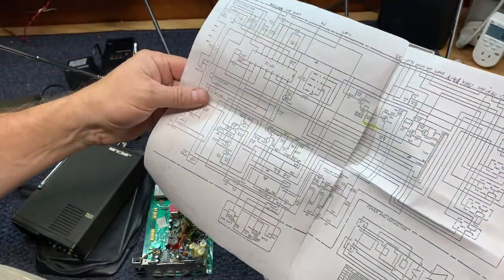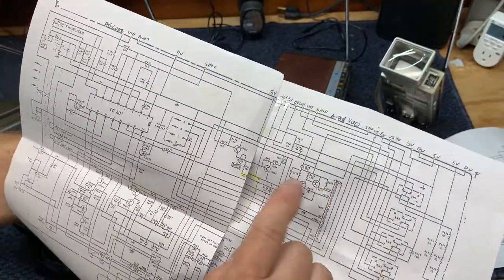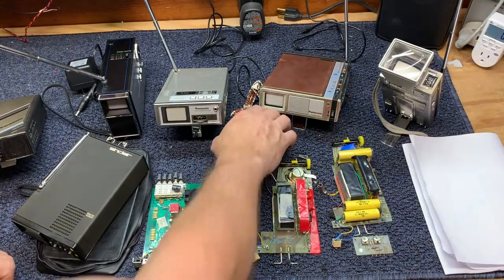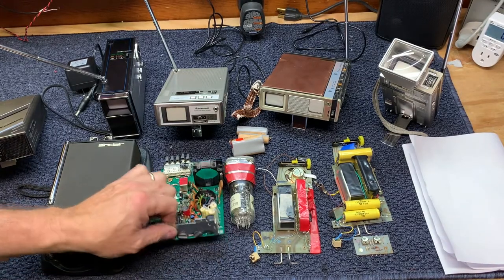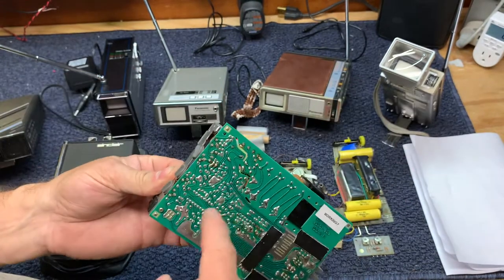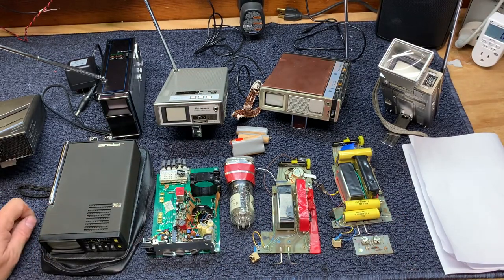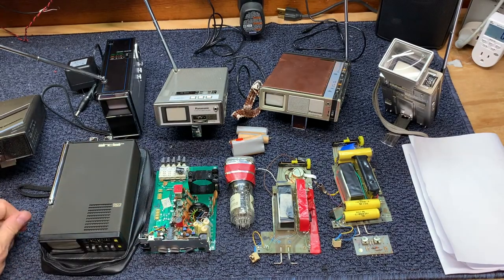Most of this circuit was bad — there were a couple of bad transistors in the circuits that produce the high voltages from this little transformer. I hope technicians working on these will reach out with questions; I can't promise I'll have all the answers, but I have a bit more experience now. This section is all high voltage — the capacitors and diodes to rectify the high-frequency AC. I was constantly touching these and getting shocked. At 2,000 volts it'll give you a zap even running off a five-volt supply — low current, but enough to make me jump and actually drop the circuit board a couple of times.